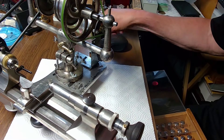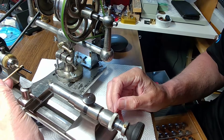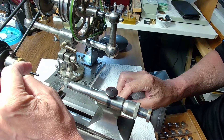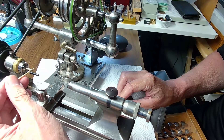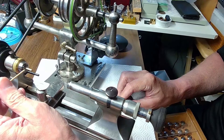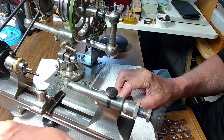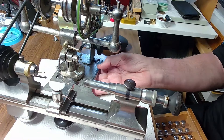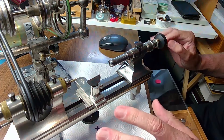When I work on a piece, I'll take a long piece of pegwood and ride it over the metal underneath very lightly while it's spinning — that allows me to center my piece while the chuck is slightly loose. Then once it's sort of centered, I tighten up. You can also use a wax chuck instead of this chuck. If you're going to do serious lathe work in the future, get yourself a set of cross slides.